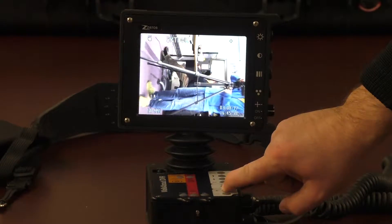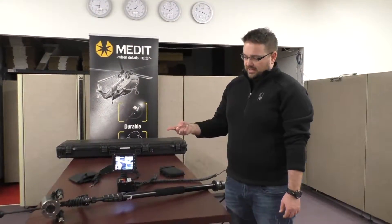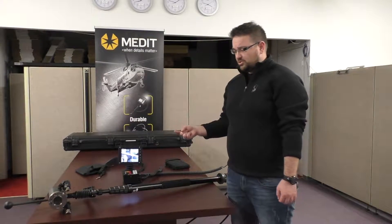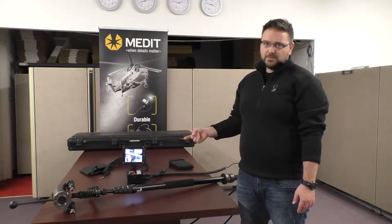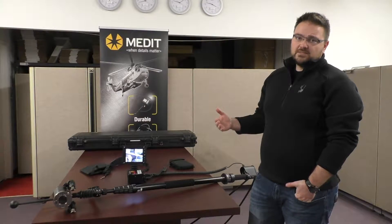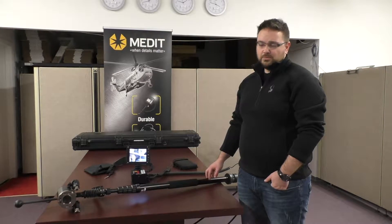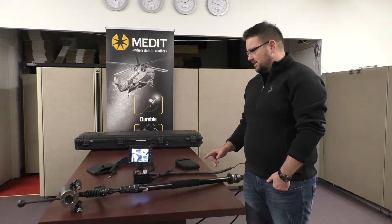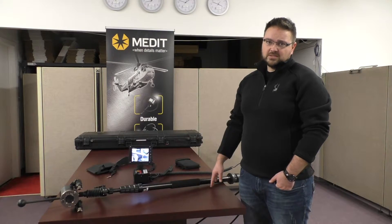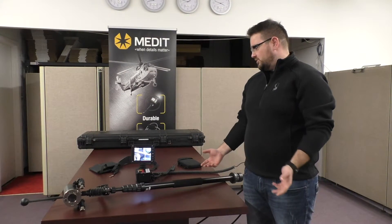To go over once again: you're looking at a heavy-duty camera head, waterproof to 30 feet, built-in LED lights as well as additional super-strong LEDs for distance inspections, 40x optical zoom, and really solid low-light sensitivity so you'll have no issues in complete darkness. Pole systems are hard aluminum — not going to break easily. The entire unit is made in the US, so you know you're getting solid quality. The DVR box does video capture so you can document all your inspections, and you won't have any issues using it in daylight.